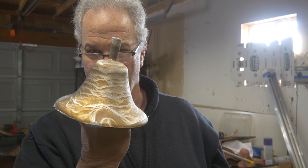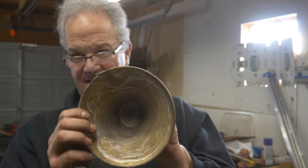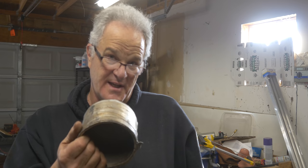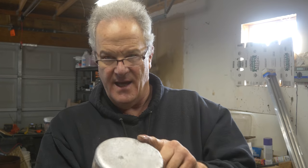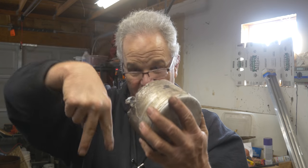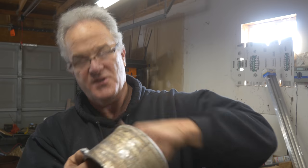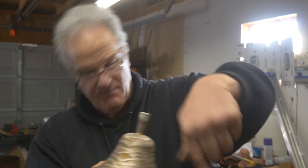The other thing I wanted to bring up is this whole idea of how this thing filled. You can see the oil marks on here from my recycled Petro Bond that I'm using — it's beautiful. What I think happened: when I did this precursor to a bell — which I'll link at the end of the video — when that thing filled, we could see the whole open surface and the outside rim, and it was filling in a circular motion. Even though it had two end gates that were perpendicular to each other — they weren't both coming in from one side causing it to swirl — the metal just started to fill the pattern just like that. And I see these same markings on this bell, so I'm assuming that's what happened: it fills in a circular motion.